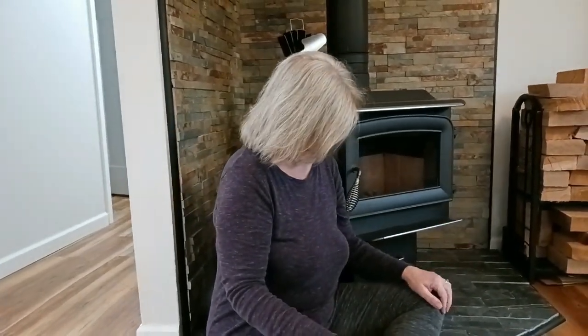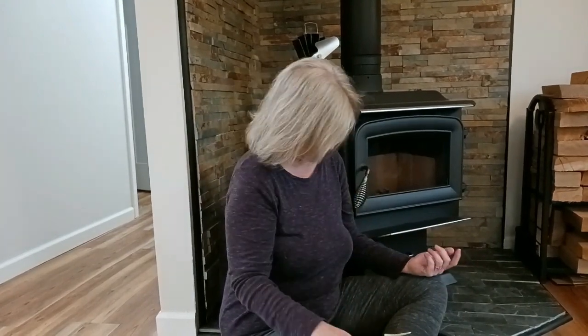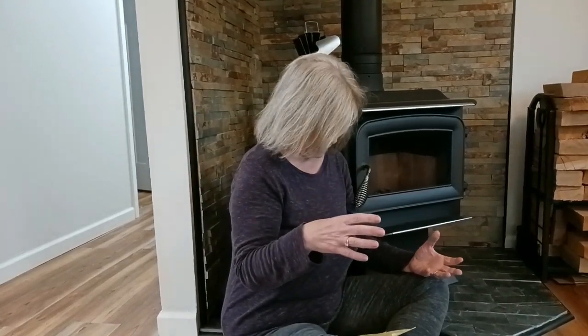And with the luck of the draw, as Bruce said earlier today, because of where this stove is positioned, when they went up into the roof, they had to cut some ceiling joists and some roof rafters and reframe those. So it is what it is when you get something like this. Next, on the roof, you're going to see Tom installing the heat resistant silicone boot, and that's to help keep our roof watertight.